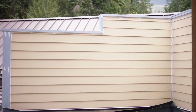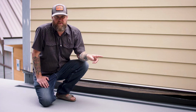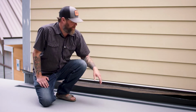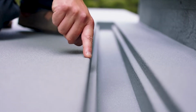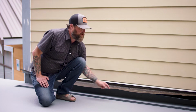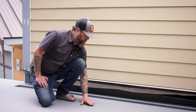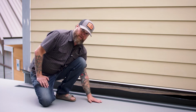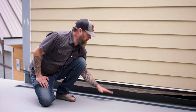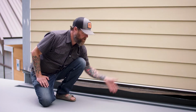Obviously, you can see a parapet wall running around the exterior of this side. Water's gonna collect against the wall. Even with the waterproof membrane here, not the greatest idea. So what we wanted to do is have the general contractor put a bonderized metal pre-sloped trench drain into the deck structure. The Polyurea wraps down and over plywood here again, and then into the bonderized metal. Seamless monolithically, absolutely zero adhesion issues between dissimilar materials, and we're done.